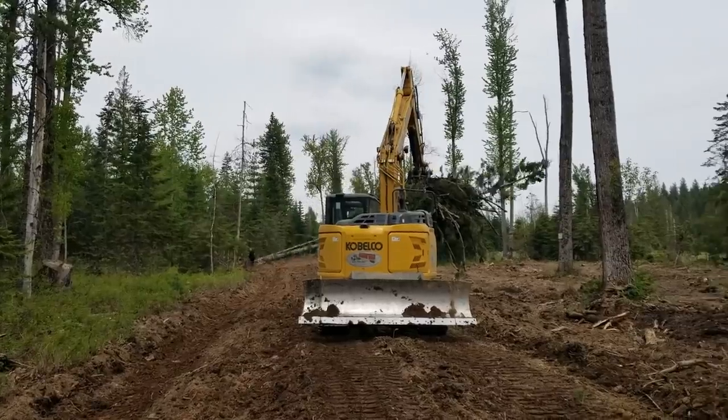When it comes to building the roads, I've got these easements along the east and the west side of the property. There's 30-foot easements for road and utilities. You can see here behind me, I've got these great big trees, and the problem is they're inside that easement. So I've got to run either the ditch along the side of the road, or the road, or utilities, whatever it might be. These trees are in the way, and it's not necessarily the tree, but the roots of that tree that are going out that might be in the way of ditch, utility, road, whatever.